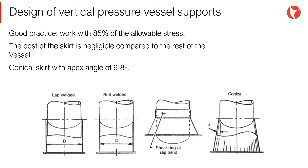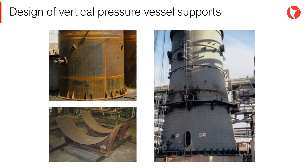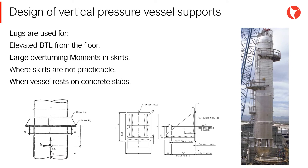When designing conical skirts, it is recommended that the apex angle does not exceed 20 degrees, with good practice suggesting an apex angle from 6 to 8 degrees. The use of conical skirts is a more expensive form of fabrication and unnecessary for most design situations. As shown in the pictures, skirts can be straight or conical, choosing the latter when the loads to be absorbed by each bolt are very large. With a conical skirt, we can accommodate a large number of bolts and decrease the pressure transmitted to the foundation. A good alternative, especially for slender vessels, is to support them by means of lugs, which results in much smaller moments in the saddle and anchor bolts.